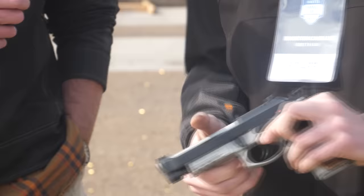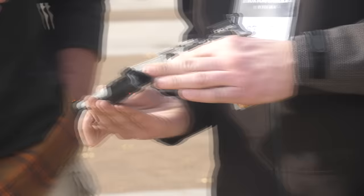The twin sear system is what allows this to be possible. With that, we maintain parts compatibility as well as durability and safety. When you decock, here at half cock, you're not contacting the slide.